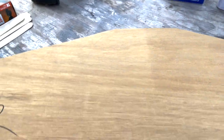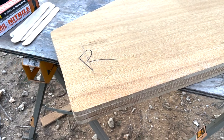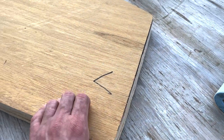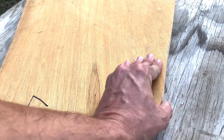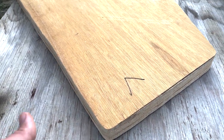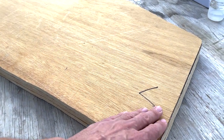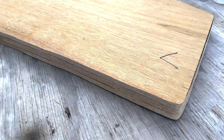What I'm going to do next is hit some acetone along the edges because the sanding wheel may leave some residue on these edges — we want to get rid of that. Then I'm going to clean the surfaces, wipe them down with paper towels, make sure everything is nice and smooth. If we need to sand any rough edges, we'll do that. Make sure if you're doing this yourself that you round off all these edges, because when you go to put the fiberglass mat around here, fiberglass does not like 90 degree turns. Even this edge here is a 90 degree turn — we will have to sand this.